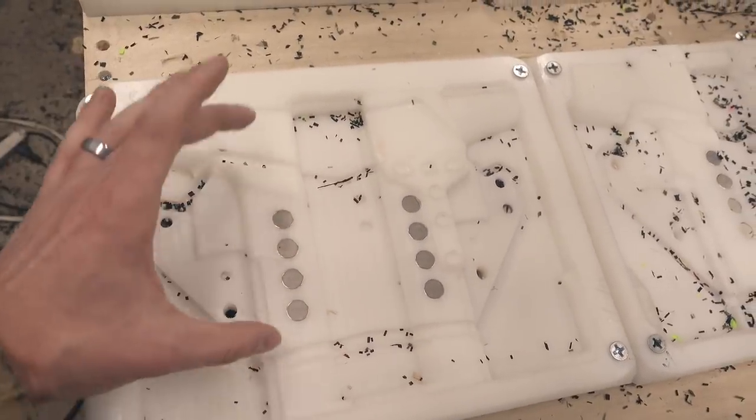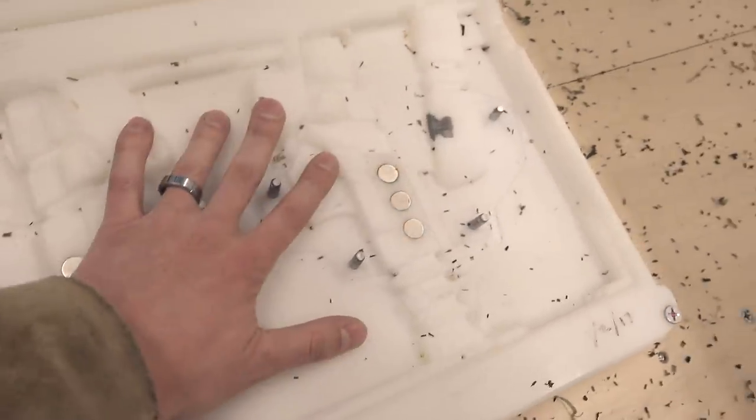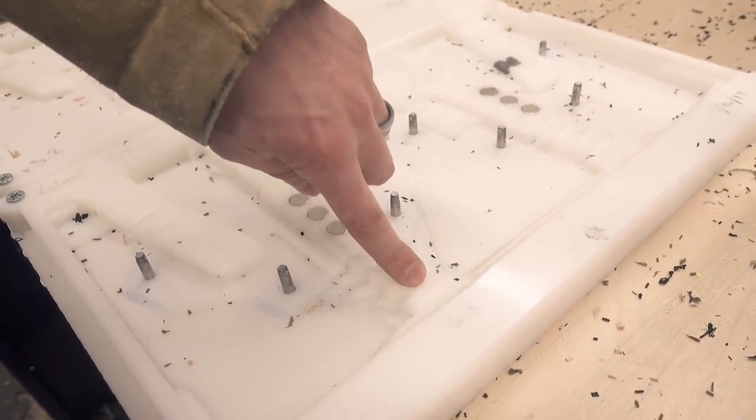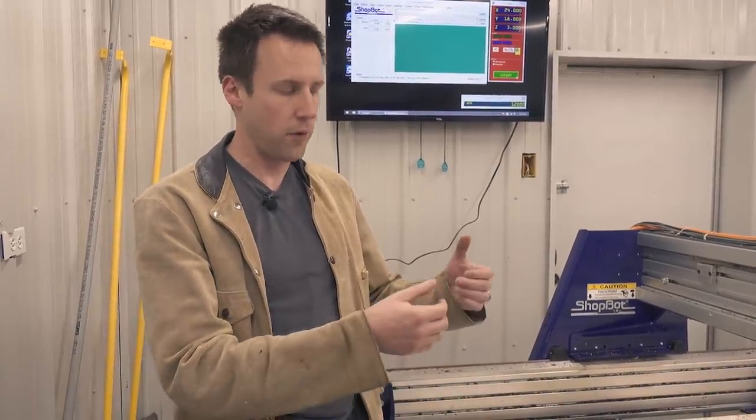Ragnaroks are generally pretty simple shapes — there's usually only one size for every particular holster, and that's how a lot of folks do their inside-the-waistband holsters too. But here at T-Rex, we like a little more variability. For our sidecars, we've got our 26, our 19, our 17, our 17 with a threaded barrel, and our 34 — and that's just the slide lengths. We also have the shirt guards: no guard, mid guard, mid guard with optic cut, high guard, and high guard with optic cut. That's 25 different cut paths just for the right-hand sidecar and 25 for the left-hand sidecar, plus a whole bunch of other guns we support. The next thing to talk about would be file management, but that's too boring a topic even for me.